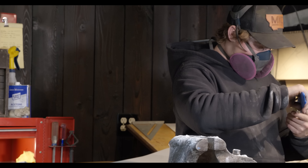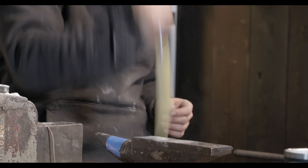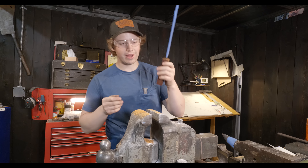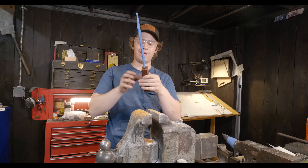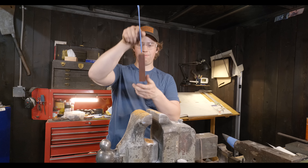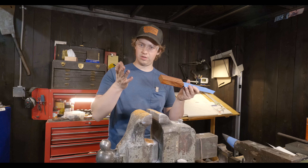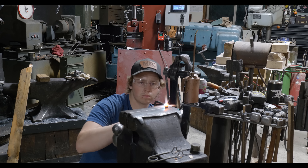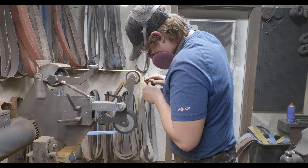Well, shoot — it cracked. I made a new handle block and it was a lot faster than doing it the other way. I just kind of drilled out loosely up top, got the block fit as fast as possible — I'm just going to fill this sucker with glue. It is mega crooked right now, but that's fine — I've got a lot of meat here to shape it, and it's a knife I'm going to bend in half anyway. Next step is to soften the very end of the tang, then get this thing flattened off, drill the pinhole, glue it, shape it, and then it'll be done.